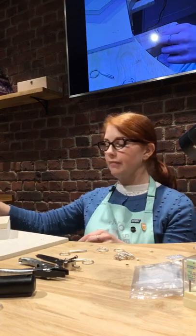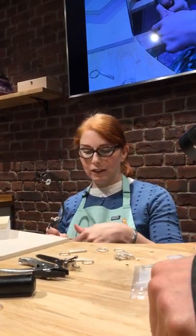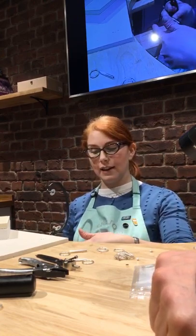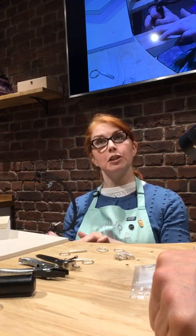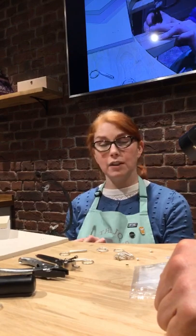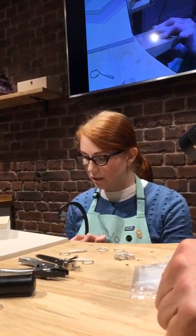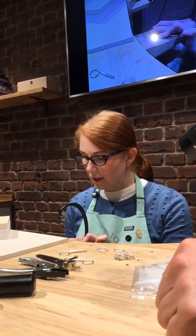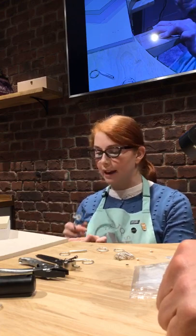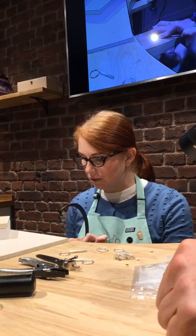Okay, and then cutting. In general, it's quite nice to have a little groove that is across your bench peg, like across here like this, that you can rest things like wire and tube into. So then it doesn't roll around as much. If you don't have that, then just try and use your fingers, and again pushing down. So the stiller that you can hold your work, the more accurate you'll be, the fewer saw blades you'll break, all of that stuff. So it's really important, and it's the thing that most of my beginners struggle with.